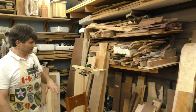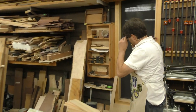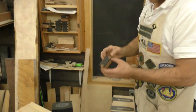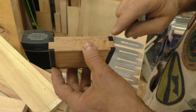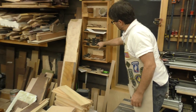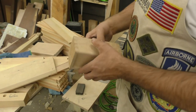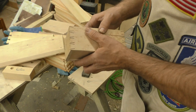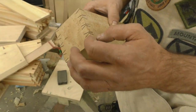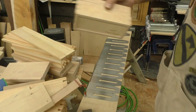This is all the wood that I can't stand to throw away, so it just keeps accumulating. I want to show you some of our wood hinge boxes. Here's one that was a reject — there's a big piece of wood missing right there — but I'll show you how it works. It's a simple three-piece system. Here's one we did several years ago that I'd love to get finished. For a twist on dovetails, the pieces are mitered, then I used the dovetail saw to cut through slots, took some ebony veneer, pounded it thin, slid it into the slot, applied cyanoacrylate which allowed it to swell and tighten up, outlining the dovetail — a neat way of strengthening a joint.